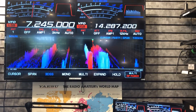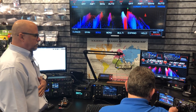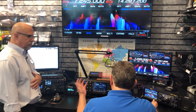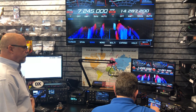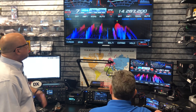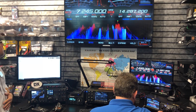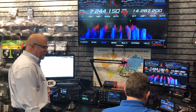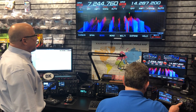The roofing filter could be changed to 3 kilohertz, which I'm changing here on the touch screen and it's showing up on the big screen. Rod, why would you want to go from 12 to 3 kilohertz on the roofing filter — also known as the first IF, or the only IF in this particular hybrid SDR radio? The reason would be to cut out interference from adjacent frequencies above and below the signal. But if you choose the wrong filter — I've chosen the 600 — that would be good for CW, but not for sideband. It's too narrow; I can't even figure out how to tune in the signal on sideband.